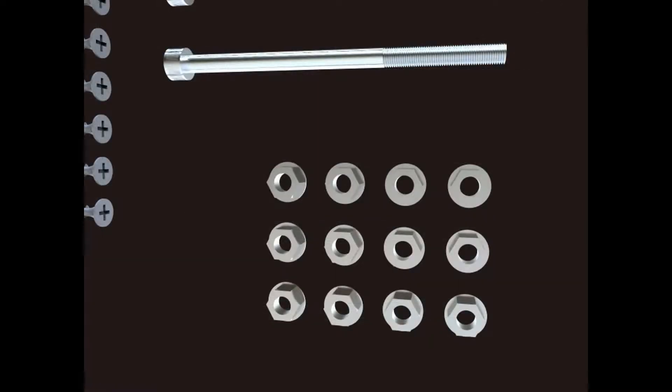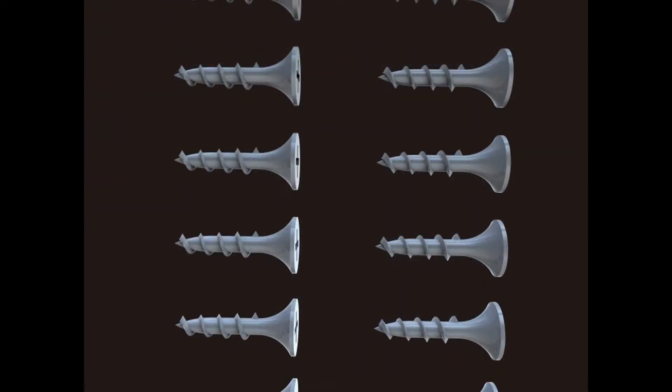Here you can see the attaching nuts — all the same size for all of our bolts. This helps keep costs down and makes sure everything fits together correctly: fewer tools to buy, fewer drill bits. These are our main screws — the shortest screws we use. They're only long enough to go through the drawer slide itself and into our three-quarter inch material. You don't want them to go all the way through, just barely reach it. The longer the screw, the better the contact and more threads in the wood, giving better attachment and less chance of strip out.